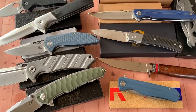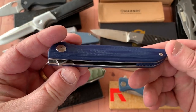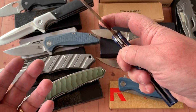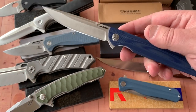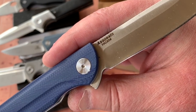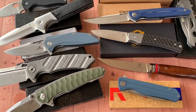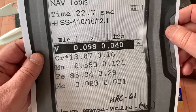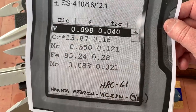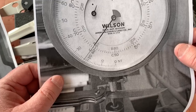We've answered that question. Next up, the Harns Assassin — I got this from Power Cutlery. A viewer asked if I'd tried it, and I'd done several Harns knives. This is a long, slender, cool knife claiming 14C28N. I sent it in for testing and the PMI confirms yes, it is 14C28N, and the HRC was 61 — pretty darn good.